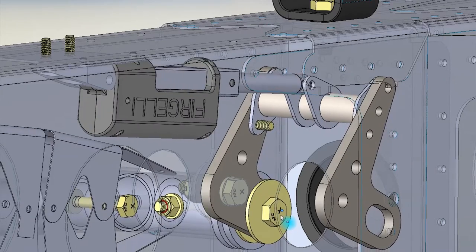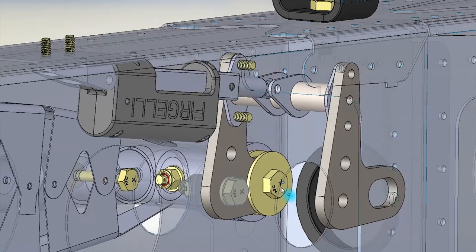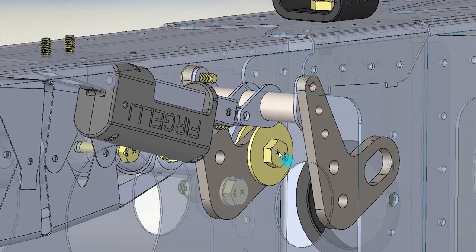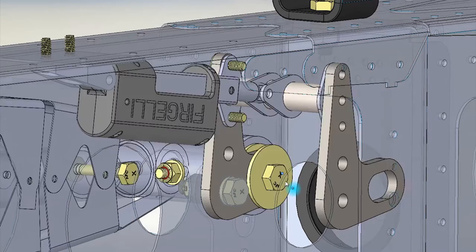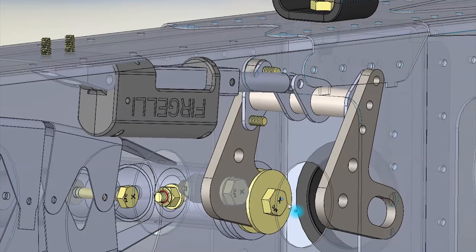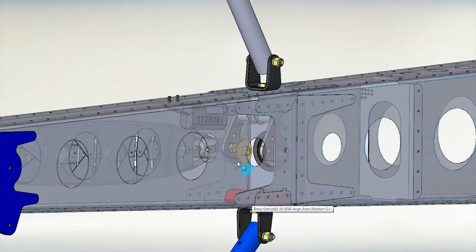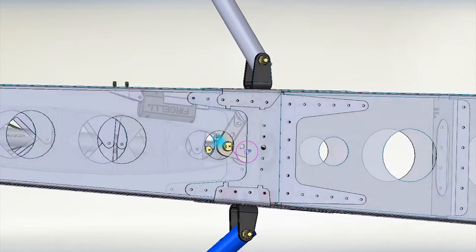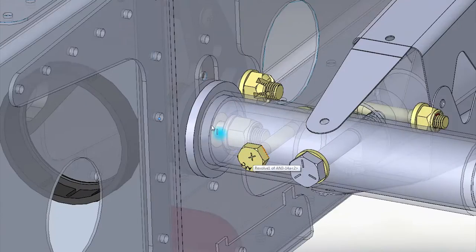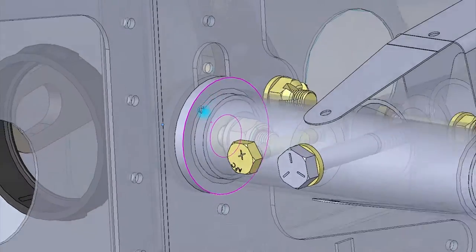That's about 112 pounds. This servo operates dual cams with a leverage ratio of 2:1, which makes the total force well over 200 pounds. These cams operate bearings affixed to the rigid fittings on the leading edge of each side of the horizontal stabilizer. The P16 linear servo weighs a mere 140 grams.